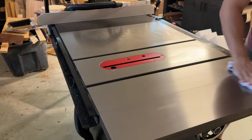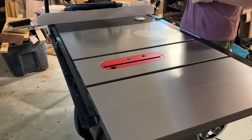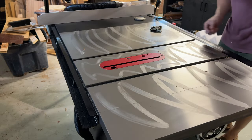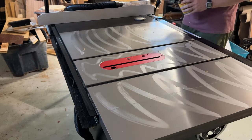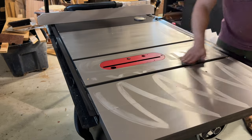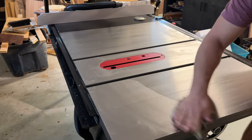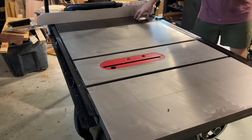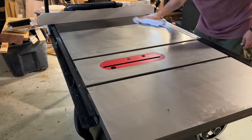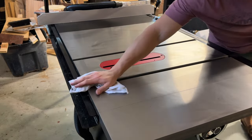I haven't given up on the dust collection issue either. I've been experimenting — detaching the hose that runs from the bottom of the cabinet up to the blade, figuring that just pulling air from the bottom will capture residual sawdust in the cabinet. I also shoved foam into all the gaps around the perimeter where the cabinet connects to the cast iron top, and that made a big difference in suction directly to the blade. After I get the sliding table and router system, I plan on redoing my entire shop to make this Harvey table saw system the centerpiece, including dust collection and automated blast gates. If you're interested in seeing that, consider subscribing and let me know if you have any questions in the comments below.